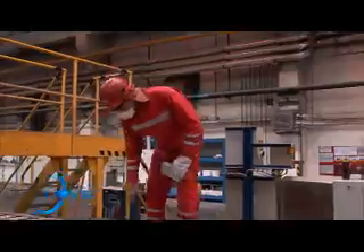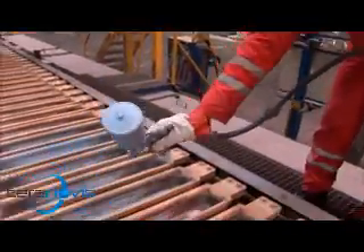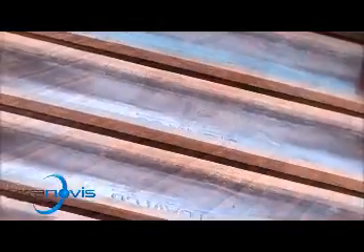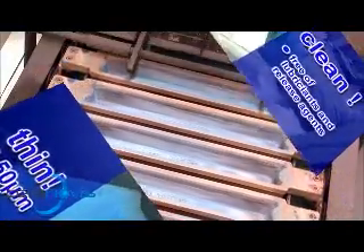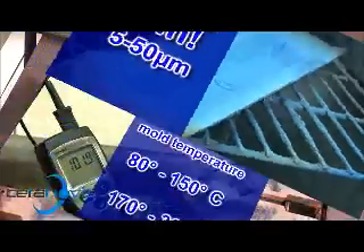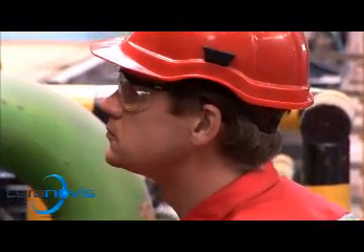When respraying, you merely need to make sure that no foreign matter adheres to the coating. Subsequent misting is also possible at high mould temperatures, and in accessible positions this can even be performed during production. A high degree of care given to preparing the mould for the first coating will allow you to achieve the desired results. Clean moulds and thin application are the prerequisites. If the adhesion properties are ideal, the user can expect extremely long service life and good demoulding results with minimal consumption.